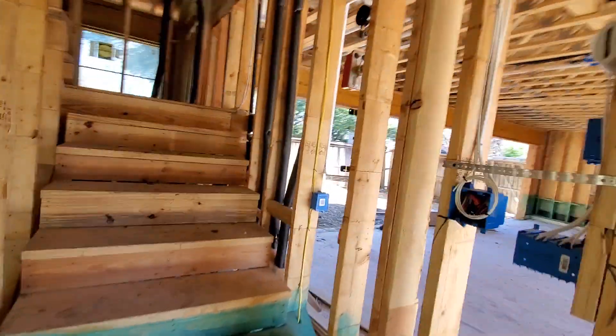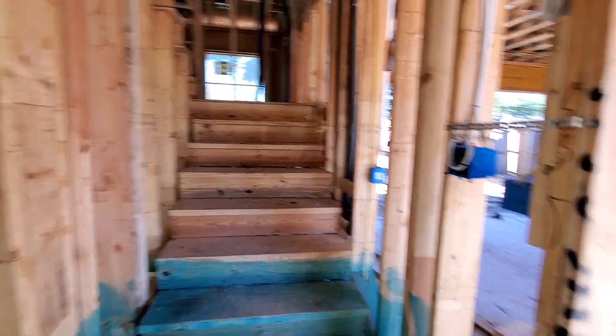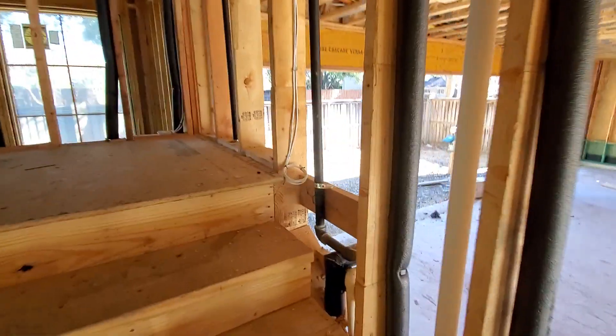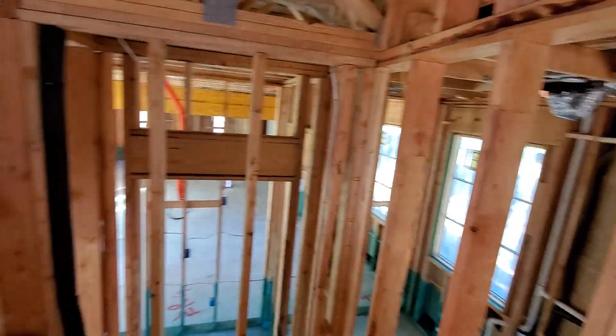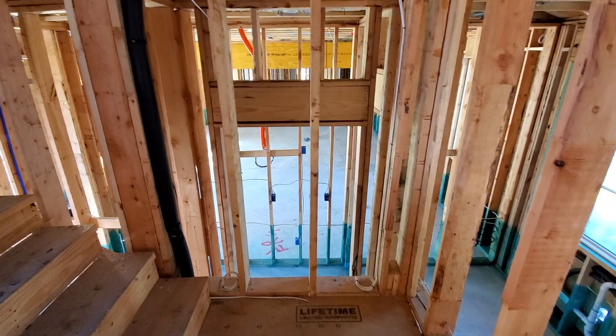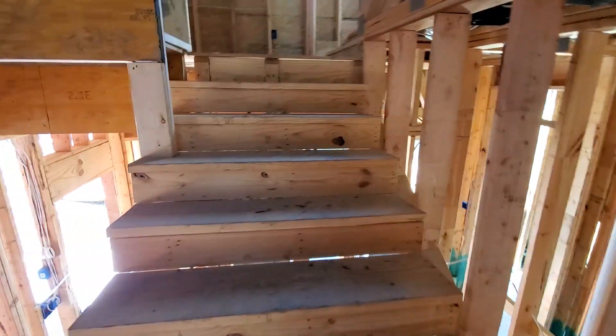We have more stairs here — this staircase doesn't have all the under lights, it just has the wall lights. So we've got a 16/4 and 16/2 there, a 16/4 and 16/2 here, another 16/4 and 16/2 there. Basically anywhere there's a turn or a break, we have to run a wire to accommodate our tracks to be in place and wired in.